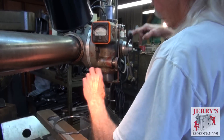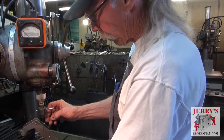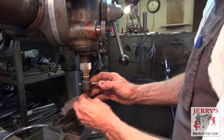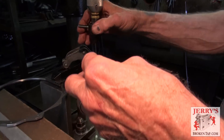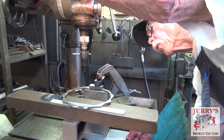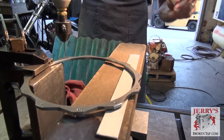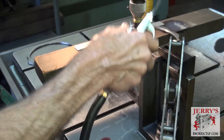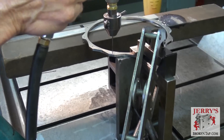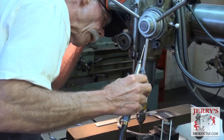We go through the same process as we did just a few minutes ago. Put the electrode up inside the chuck. I have to zap this one time to get rid of the water. We'll bring it down to the face and get the electrode centered over the tap.